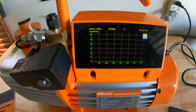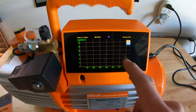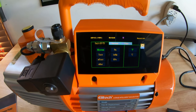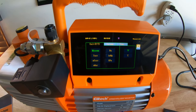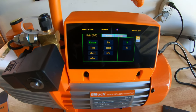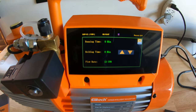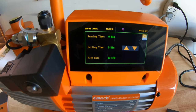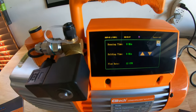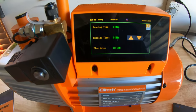You've got a graph here. I just kicked it on briefly with the cap on, but it went straight down to zero — this will graph your vacuum. Pretty slick. And then we've got settings. I've got it set on micron, but you've got all the other vacuum ratings here. You can put Fahrenheit or Celsius depending on where you're at in the world. System run time: running time zero minutes, holding time zero minutes, a flow rate of 12 CFM. As you run the vacuum, it'll tell you how long your pump has been running and the holding time as well.